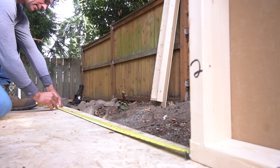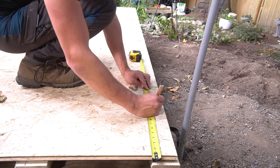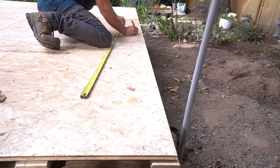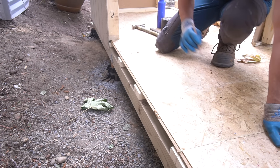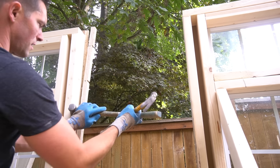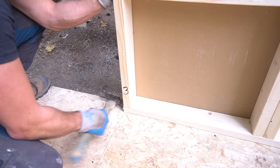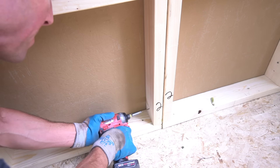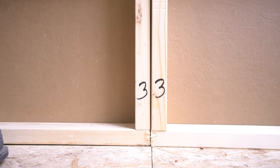With that in place, I move on to the opposite side of the first wall we installed. Before bringing up any other walls, I go around the perimeter and mark out where each wall system should end, along with the numbers that should be correlated with that panel. That way I can guarantee that this system is being installed in the proper order. This is also a perfect time to note exactly where those floor joists lay so we know we're drilling straight into them. Once our next panel is resting on our floor system, I remove the lip guard with ease and slide it into place. The fact that each panel is labeled so clearly makes the installation process extremely easy.